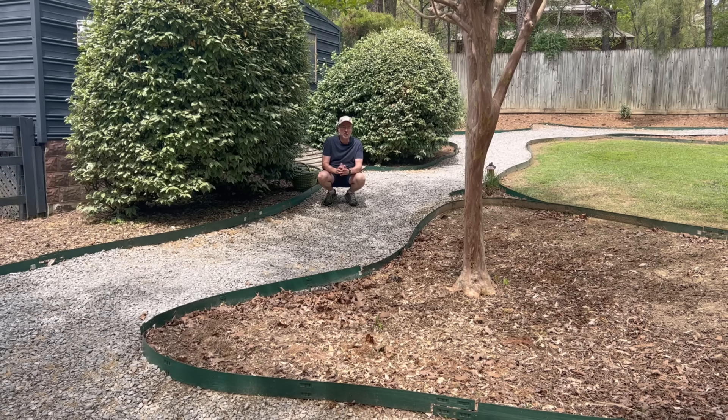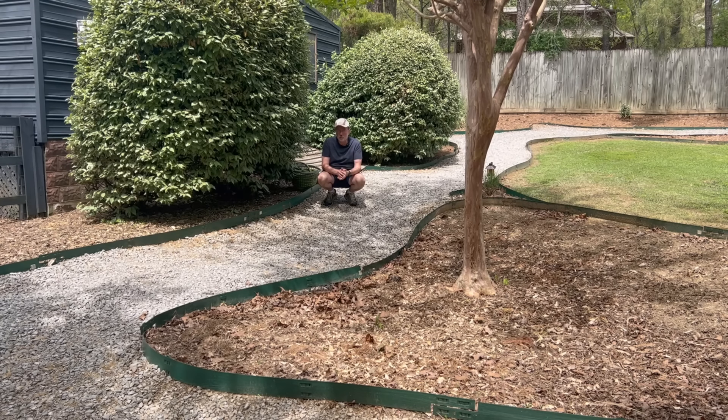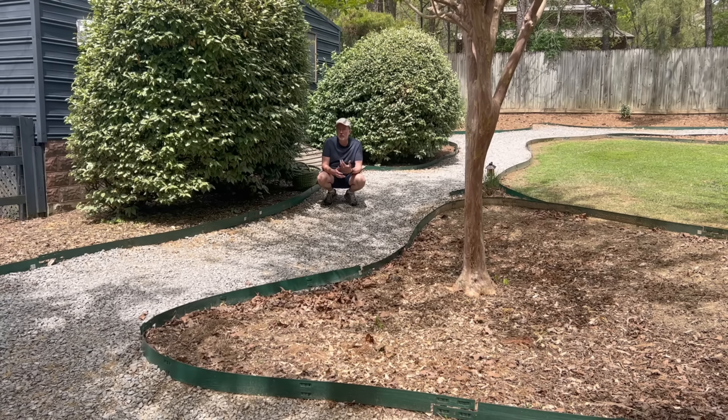Laying a gravel path is one of the easiest ways to really improve your garden. It will last for decades if you maintain it and keep weeds out. This is number 57 gravel — one reason I like to use it in my gravel paths. These paths are not only for walking, but I also drive my riding mower on them, which can be a problem with pea gravel because it gets pushed out. For wide paths with mowing equipment, lawn mowers, and heavy foot traffic, you want to go with number 57 — I believe it's crushed granite. It's throughout my entire garden. If you live on a hilly side or get a lot of rain, even number 57 can wash out.